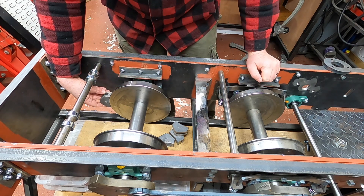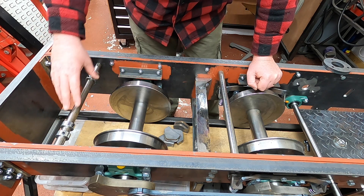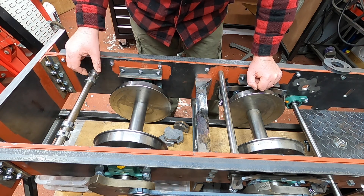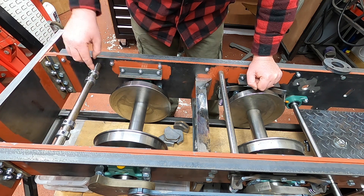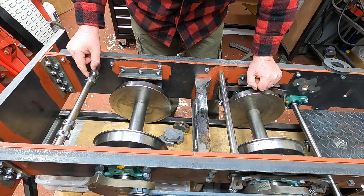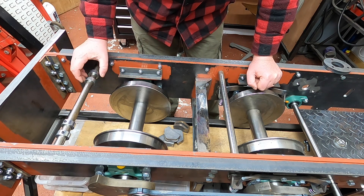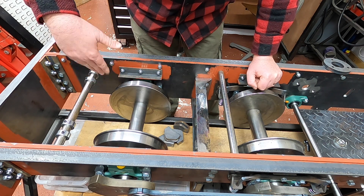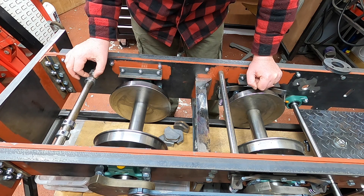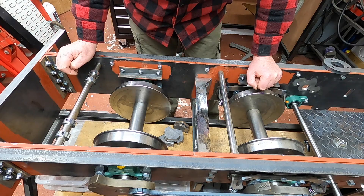The brake blocks hang off the hanger. Now to stop the brake hangers moving around on this rod, these can be clamped into place to keep the brake hanger from moving too far. The brake hanger is just a piece of flat bar, so I'm going to make a boss that goes between here — a loose fit, because it doesn't need to be bushed or tight. It needs to swing a little as well, so we'll make some bosses that go between there that we can weld the flat bar on for the brake hanger.